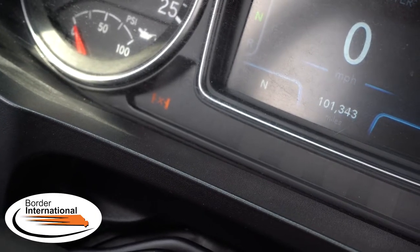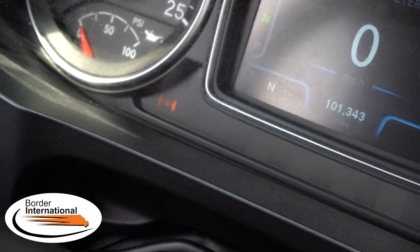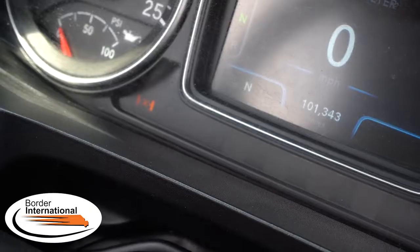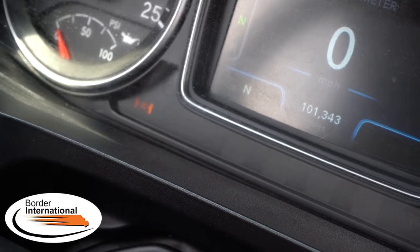There will also be a light configuration on the left side of your main instrument panel — it's an axle icon with two tires showing, indicating it's locked up. This is good up until 25 miles an hour. Now if you exceed 25 miles an hour, you're going to see the green light in the diff lock switch blink and the icon on the main instrument cluster will also blink. This indicates the diff lock switch automatically canceled itself — you can't run it more than 25 miles an hour, because all the weight is on one drive position, which gives you added traction along with the positive traction.